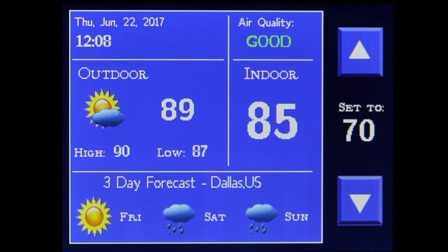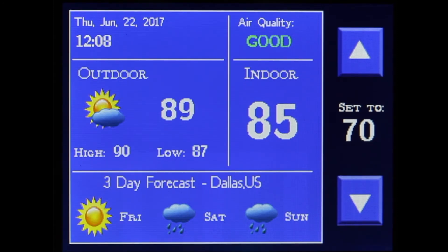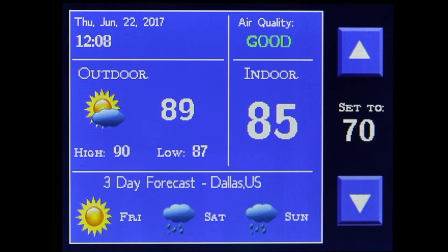The air quality sensor data is also shown on the screen. This demo also has a buzzer and an ERM motor driven by the MSP430 FR2633 MCU to provide beeping and haptic feedback when pressing any buttons. When there is no activity for more than 5 seconds, the demo will turn off the display.